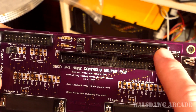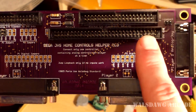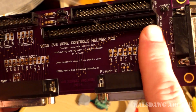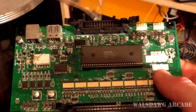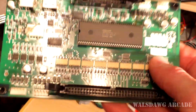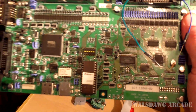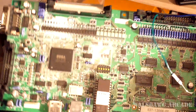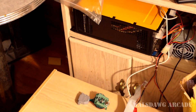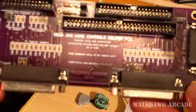This right here is a 40-pin connector that will connect via ribbon cable to a revision 2 Sega JVS IO. The 60-pin connector here will connect via ribbon cable to a revision 1 and revision 3. This is a revision 1 — probably the most common one you'll find on eBay — and it will work for probably 80% of the games that require a JVS IO. Some games on the Lindbergh require revision 2 and won't even boot without it. There's also a revision 3 that's more expensive and harder to find, but it will work with this PCB as well.